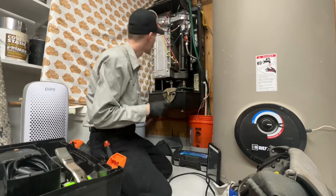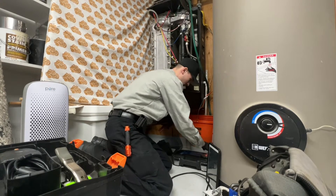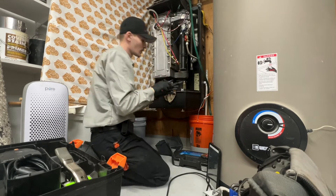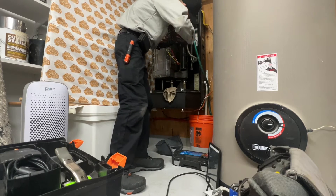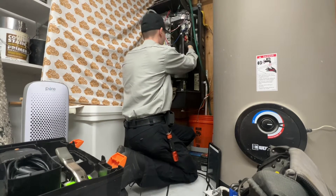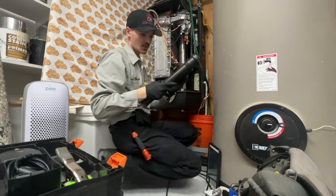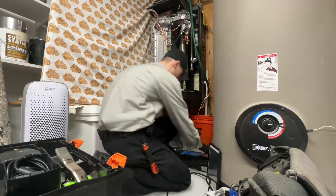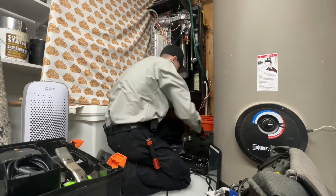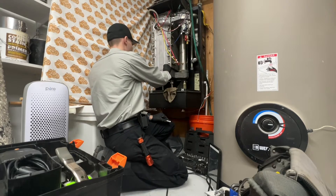Already turned off power and disconnected the gas. Now we can take off this little flex hose. Prop this silencer off, smooth it over later. Before I'm actually taking these off, I'm going to inspect and make sure I don't see any cracks on any of the flanges, because I see that often.